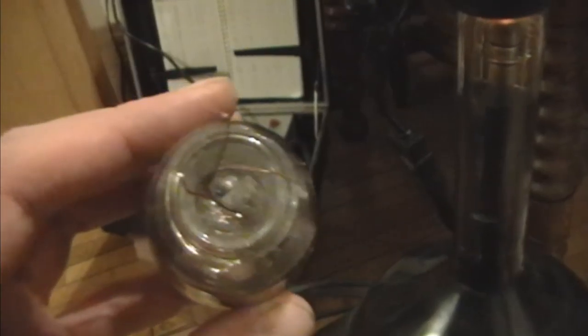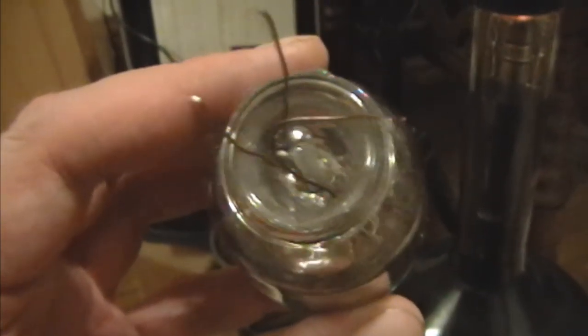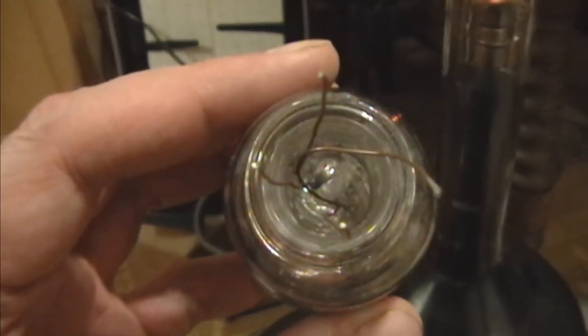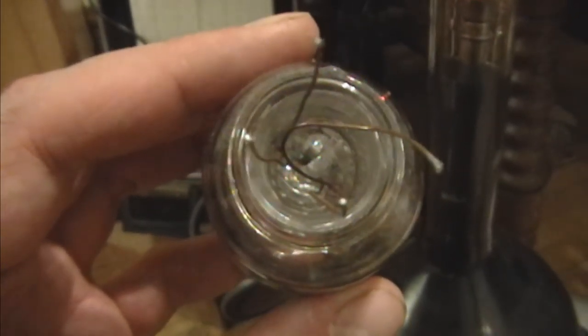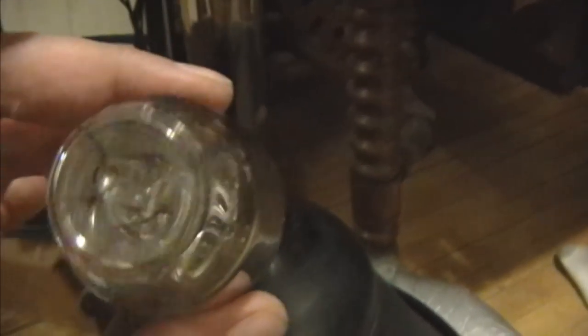Something else I dug into: remember I was talking about the Brunswick 5KR Type 26 tubes and how one of the tubes that came with the set had a dead short? Well, I got curious and pulled off the base — look at how one of those leads is all twisted around. What do you want to bet that's why the tube is reading a dead short? So tomorrow I'm going to attempt to re-weld the cathode and/or grid inside this tube and fix this base. Hope to see you guys next time.